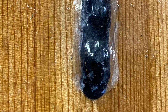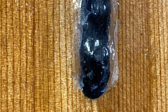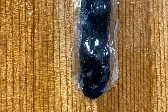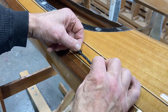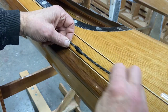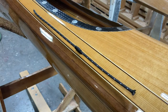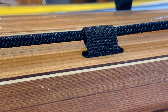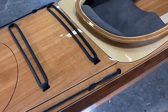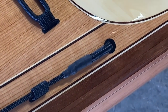Here's a view of the underside of the deck showing the mushroom cap of the pad eye and the sealant. You can install the redfish soft pad eye with a very low profile, very tight to the deck, or by making it a little longer, it'll allow the perimeter deck line to stand off of the deck, which makes grabbing the line much easier in an emergency.